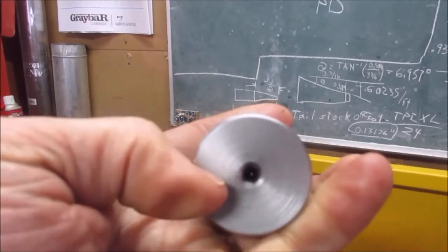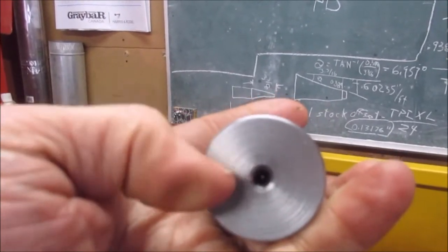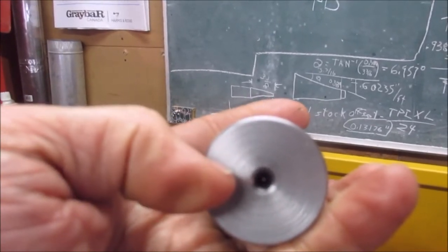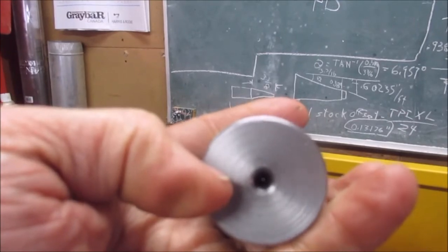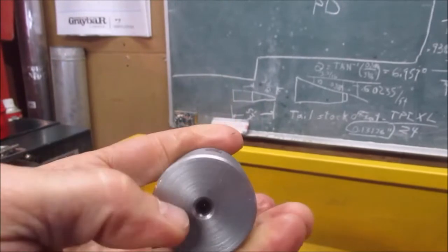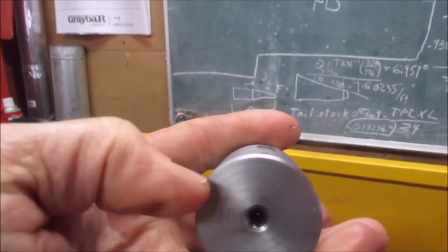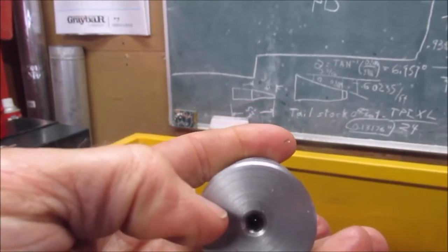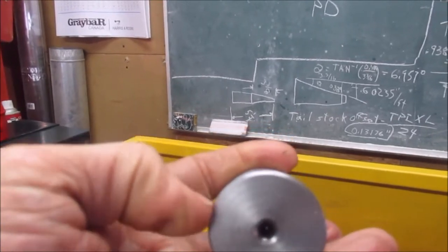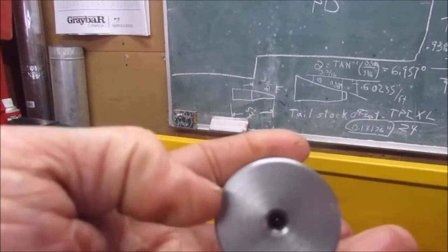And you give yourself a 16th of an inch larger than the 3/8, or than the quarter. You go to 5/16, so that way when you grind your cutter, you can offset it by that much, by 1/16 of an inch. That will create a relief angle in the back of the cutter.